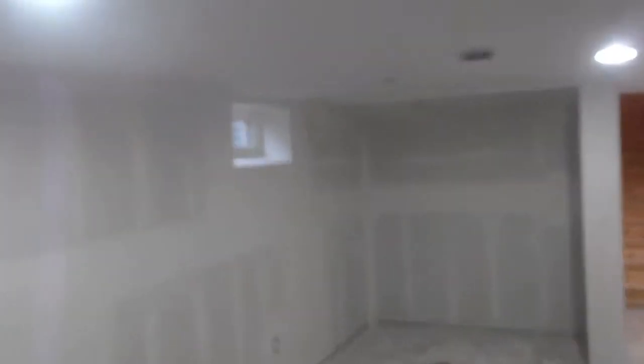This is actually the bathroom. So I put up the cement board backer. I contracted out all the sheetrock just because I wasn't going to do that — it's not my game. I've done all the electrical in the basement: all the outlets, all the wiring. The soffit — I had to design the soffit to go around the basement ducting. This is actually an unfinished wide-open block basement to begin with. I contracted out to get an egress window built down here because this is going to be a bedroom, kind of like a master suite. That's going to be the bathroom.